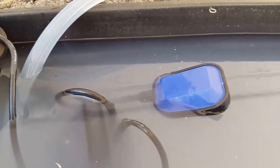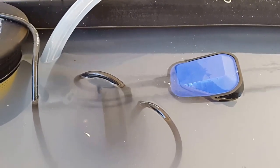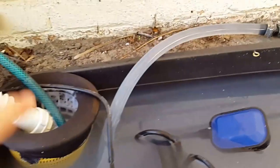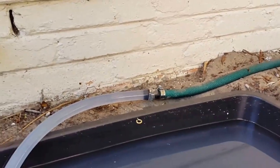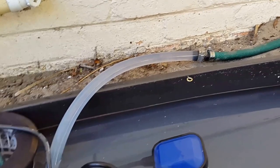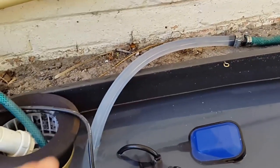You can see the water level dropping slowly as it's pumping. This pump is rated to pump 8,000 litres per hour, which is about 133 litres per minute at maximum capacity. But when you reduce the outlet pipe size and you have a long distance of hose pipe to your sprinkler, it reduces that pressure — but it's still sufficient to work well with the sprinkler if you connect a 20-millimetre hose pipe to the outlet pipe.